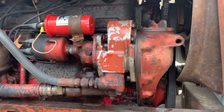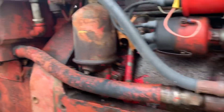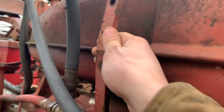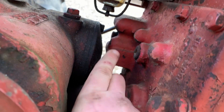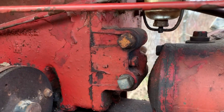This is an International factory live hydraulic setup. You can see this big suction hose goes back to the reservoir. The big tip-off here is an aluminum pump — you can see how the distributor goes on and everything. On this one you get this lever here, and you would pull this back to put power or pressure to this port here and a couple on the other side. These two ports here would also have pressure when that lever's pulled.